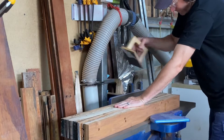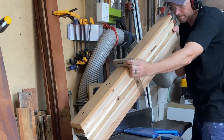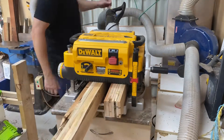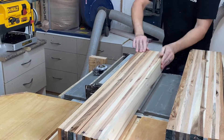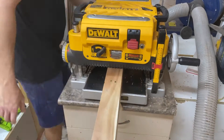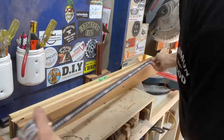Okay, my squaring up process — that's what it's all about these days. Getting things nice and square really does make your life easier when it's actually time to build the furniture. Using the jointer, the thicknesser, getting everything looking nice and square. I'll run through the table saw, cut everything to size, then throw it back through the thicknesser — to get rid of the saw marks but also thickness it down to final size, making sure the profile remains a nice square.